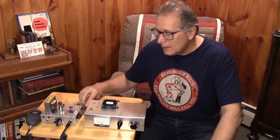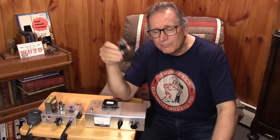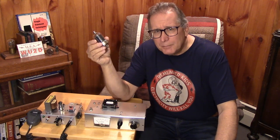I have to cut this video off because it's getting a little long — we'll do a second part to finish it up. But I wanted to make a point that the problem with using linear amplification on an AM signal comes down to how much you're transmitting. With AM, even if you're not talking, you're putting out a steady carrier. The tube has to be able to handle that all the time. As you add the sideband energy when you're talking, things change with the amount of dissipation, but not markedly. The limitations are really coming down to the dissipation of the tube.